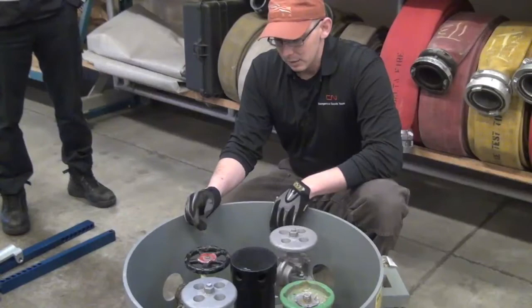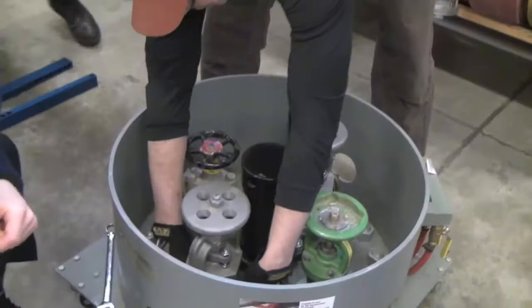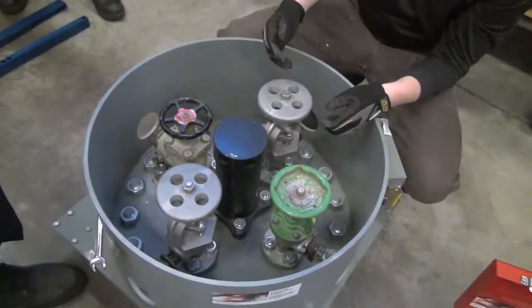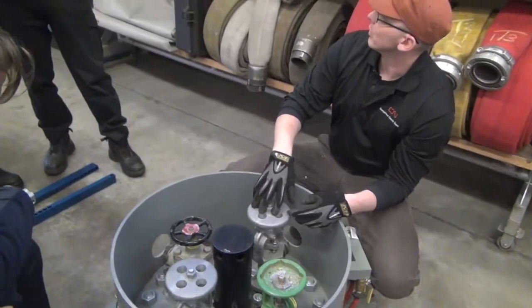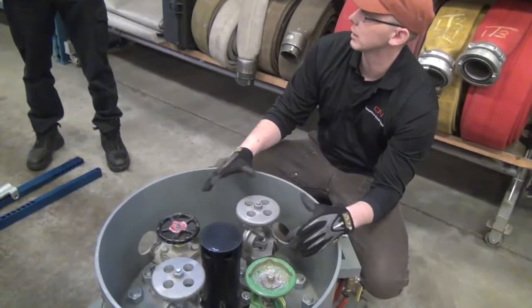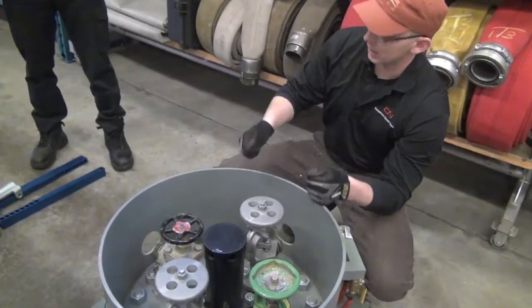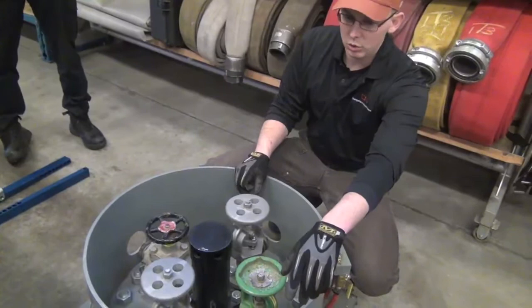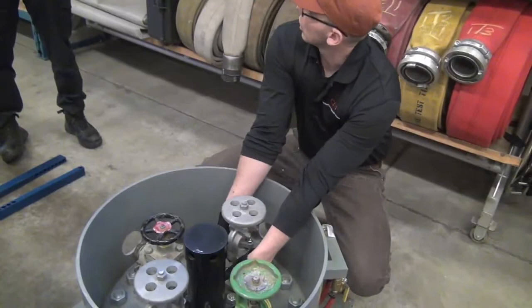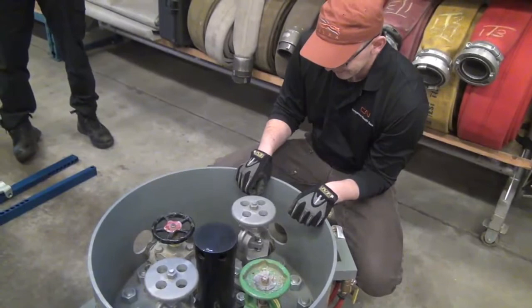If that doesn't get it, the next places these valves can leak - everything in here is bolted to the pressure plate of the car with four big nuts. It's a tongue-and-groove gasket, machined with a nice groove in it, the gasket drops in there, and there's a tongue on the bottom of the valve. We've seen instances where a car was reassembled in a warm location like California in winter - still significantly warmer than Edmonton - and that gasket shrinks enough to lose its seal. There's a crow's-feet wrench in the Midland kit that lets you get down onto those nuts and tighten them up in a crisscross pattern, just like lug nuts on your car.